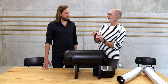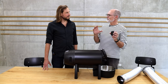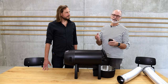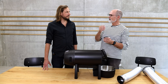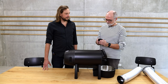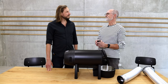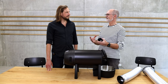But in between, they usually go down to like 20% infill. That would be sufficient for normal temperature and stability and everything. But you need to go up to like 70, maybe 80% infill in order to have it rigid enough, even with higher temperature. Okay. So ABS or nylon with an infill of at least 70 to 80%. As high as possible. But of course, it gets more expensive. It takes longer time to print. The more dense you want it.